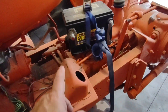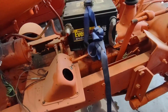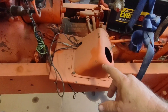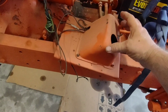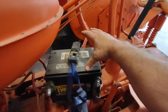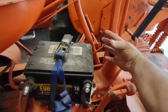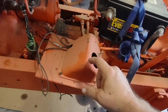I want to get this redneckery mess out of here. I've got a battery box for it but the battery that goes in it is bad, so I need to get a new battery. The previous guy working on this tractor made a new battery box, new cover, and mounted the controls to the top of the lid. That's not really where they're supposed to go — it puts them too far back. These controls are hard enough to reach when you're sitting clear back on the seat, so the controls are really supposed to be on the front of the battery box — that way they're a good three or four inches closer to you. We're going to work on getting that off.